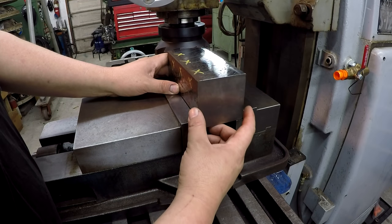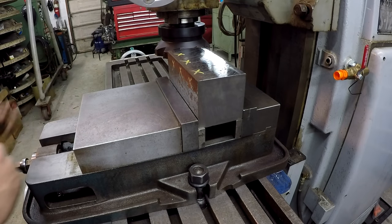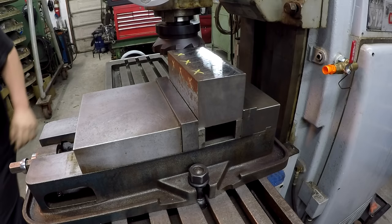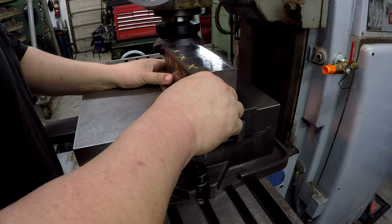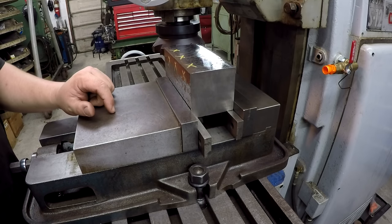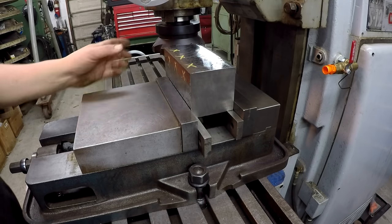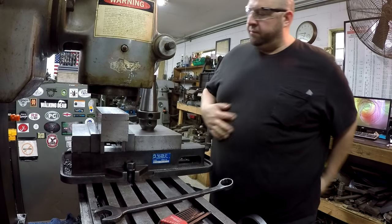The first thing we'll do is use this other side and go ahead and do some side milling to square the block up. I may hang it off this other side — I just seem to get a better shot with the camera looking this way. Let's break this down, find a good end mill, go in there and rough these sides up, bring it to size. We're going to go ahead and do our side milling.